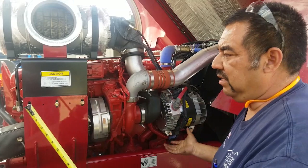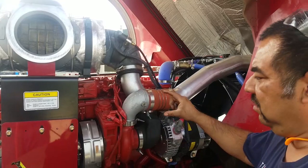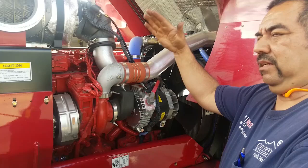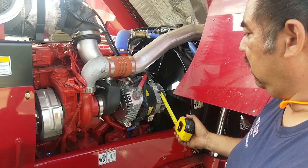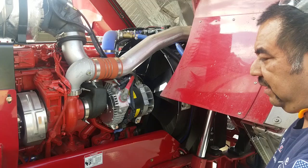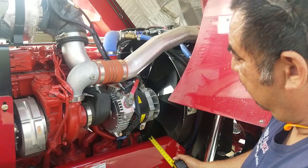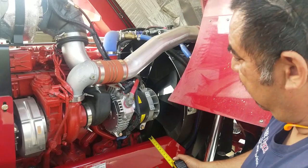This is a digital indicator that tells you if the air filter is dirty — it'll tell you on the dash. There's a little plunger in there. If you're not sure you can reset it — you're not going to hurt anything. As soon as you get on the road and take off, it's going to tell you where the filter is at. This is the new brushless alternator — 540 amps. It's pretty high tech and new to us, so we'll see how they work. From there, make sure all your hardware is there, looks tight, and your cables and stuff aren't fraying on something.